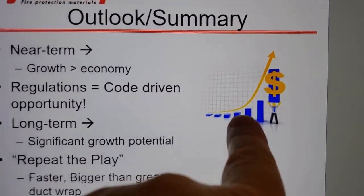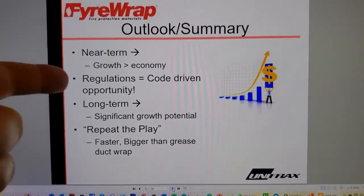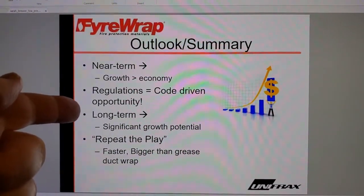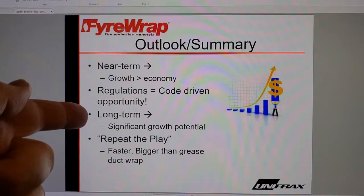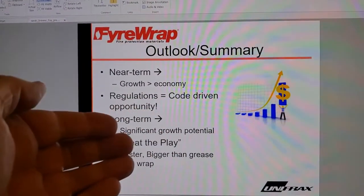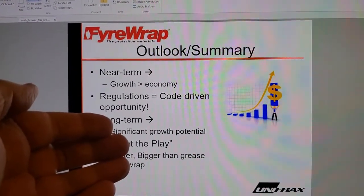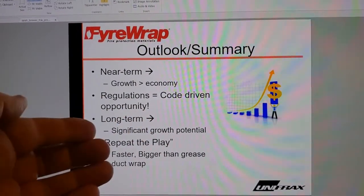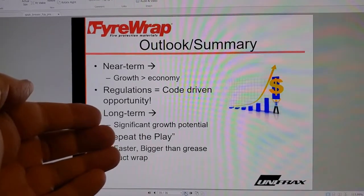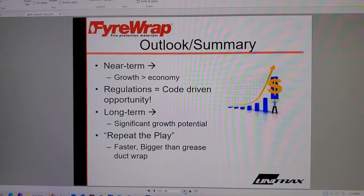it's okay for everybody to make good money, but smoke exhaust is irrelevant because return air ductwork does not have a requirement in the code to be fireproofed. So if that's out of the way, until somebody finds a reason to convince code officials to go for the extra expenditure of fireproofing return air ductwork, until that happens, the only thing really at issue is pressurization. If the fan is toast, the pressurization ductwork is purpose-free.